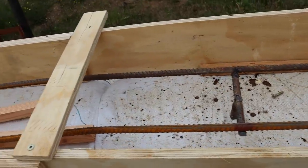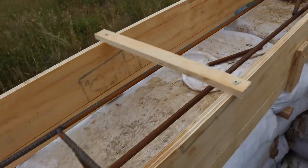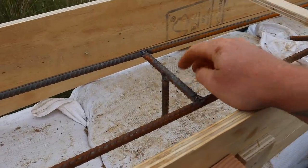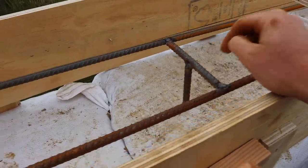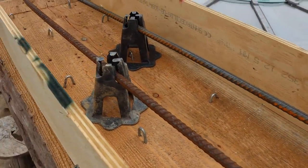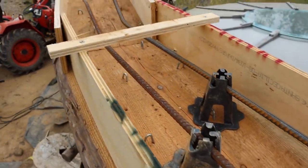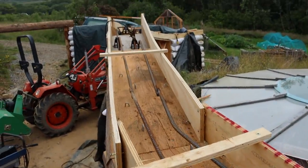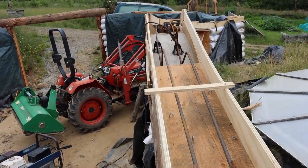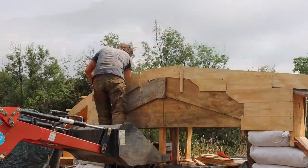Look at the rebar, nothing special, just bending it around as we go, and then those T pieces I made going down through the bags a meter, and then comes over the window with some standoffs, some U-nails in the window to bond it to the window frame, and it goes off, just bending round. It's bent over the curves, it's all in the curves. Yeah, it just works it all the way around like that. Should be nice and strong.